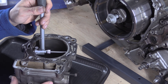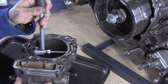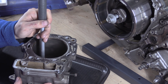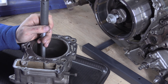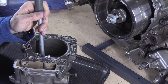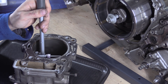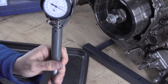Like I say, I'll do a video actually measuring these properly. I just want to show you what you do. You'd go down the bore here and measure that. We're getting a smaller dimension further down. One of the best things to do is go down to the spigots, measure right at the bottom, and then come up and measure the difference all the way down the bore — you're just looking for the highest measurement.